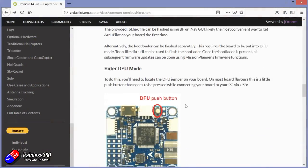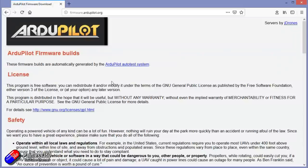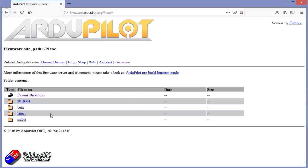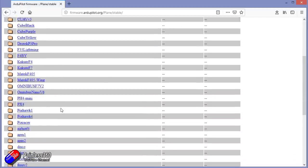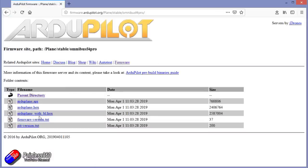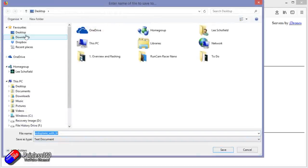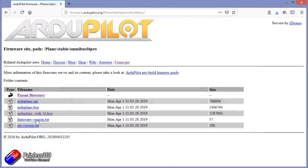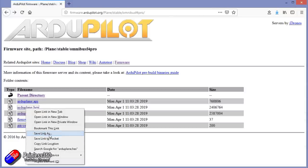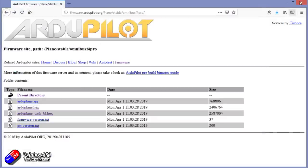Scrolling down on the page for the board you're interested in, you'll find the link to the software. Clicking on there, you'll find the directory structures. I'd go for the latest version in the stable directory. In there you'll find the different versions for Arduplane, Arducopter. You want to download the one that ends in the underscore bl.hex extension, because there are two versions of the code. One is if you've already flashed the board once with the bootloader version and are going to update it in Mission Planner — that's the one without the underscore bl in the name. Right-click, select Save As, and save it onto your computer. That is the firmware we're going to use in iNav or Betaflight.